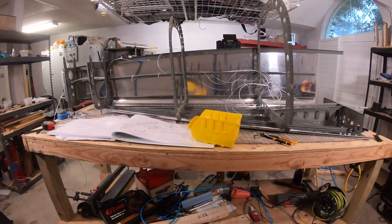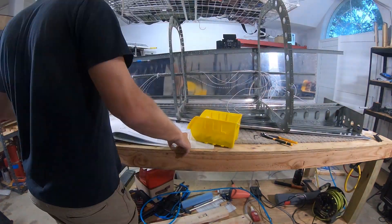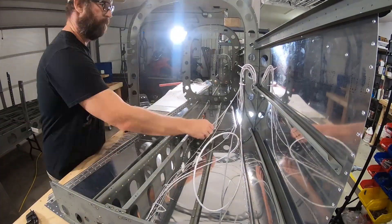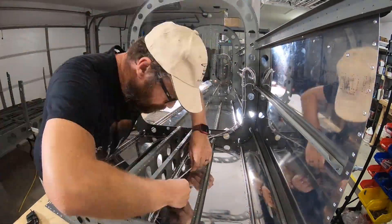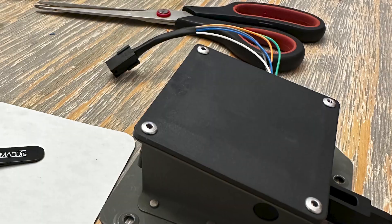Van's, send us that Molex plug. You put Molex plugs on everything else, and then on the elevator trim it's bare wire and the Molex plug is not included in the bins. So we ended up finding it on Amazon, got the kit, got it all wired up, wouldn't plug in — realized my definition of male and female is different than Molex's definition. So we cut those pins off, put the right pins on, and all the testing we can do, we think that the trim's going to work.